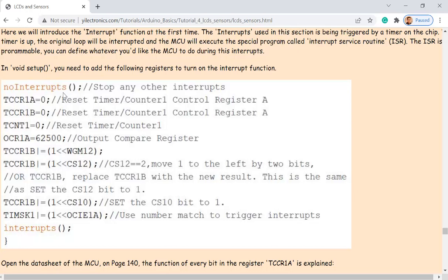Why do I want to do that for the temperature sensing of the hot tubs? First, the temperature of the water is not changing every millisecond, right? Second, think about, since you have been working on the seven segment display, for example, if we are using four digits, okay? What's going to happen when you need one loop to run the display? How that works is, you need one main loop to run the display. It's activating every single digit very quickly and showing the number, right?